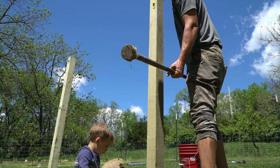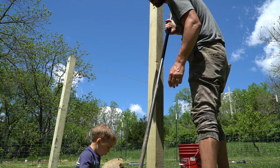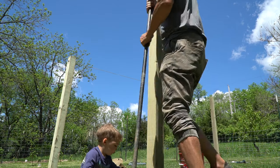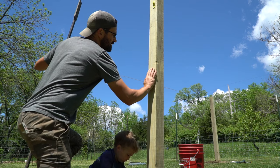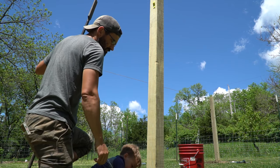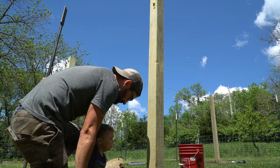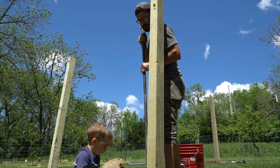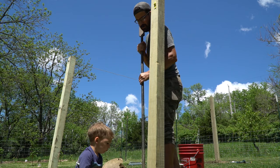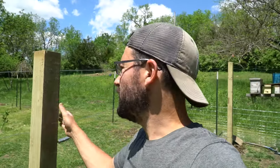Here's the end of the rock crusher that flattens the soil in. We're layering our drainage rock and soil together, mixing it — almost like creating our own concrete. One crucial thing when putting this post in: you want to make sure the face is flat toward the other side you're going to, because when you put the wire vise through, you need a flat surface. We'll knock this post in, do the other side, then move on to the wire vises and wire. This is why we left a good-diameter hole — the rock crusher needs room to tamp the dirt down.